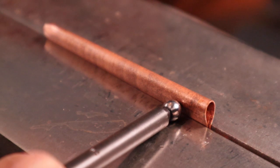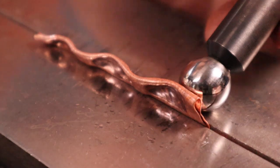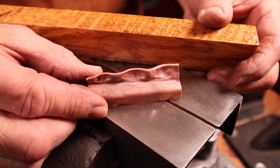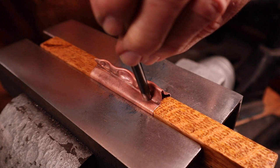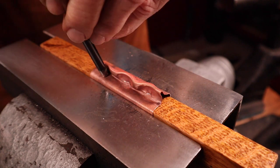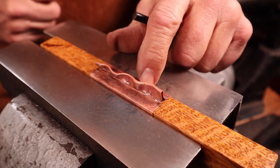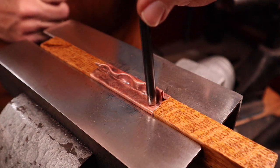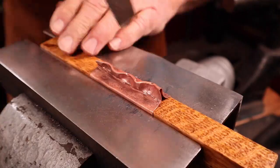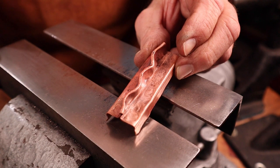Let's go for a serpentine shape with this one. Now that I have the basic serpentine shape, I can go ahead and stick it on the block of wood and then sharpen up all these edges. You can see that putting it on the wood really made a nice base for me to come in with the flat chasing tool and flatten that whole area and make that edge nice and sharp. And there we have our serpentine air chased line with a little texture.